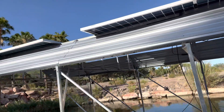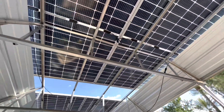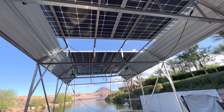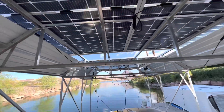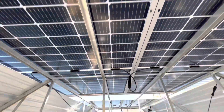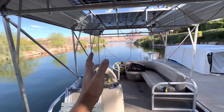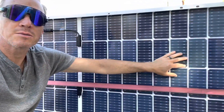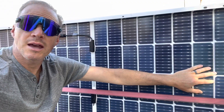It's not quite the look I was going for, but the main thing is that we get shade from this. Look up underneath at the bifacial design — it makes for a really quite attractive canopy from the inside and provides nice shading. One thing I'm noticing is that because they are double-glazed they are heavier units, making about 250 pounds worth of panel up here. Being almost eight feet up to the top, the boat has a little bit more back-and-forth to it when you step on — a little top-heavy. These are equivalent to the 72-cell full-size panels, same output, running about 48 volts and about 11 amps.